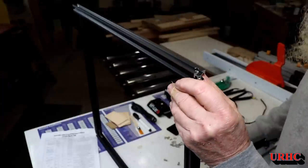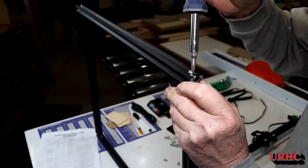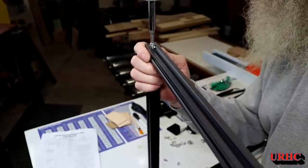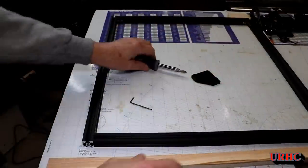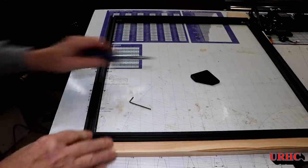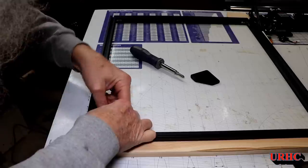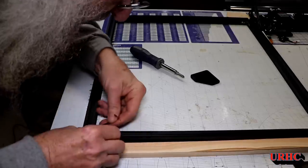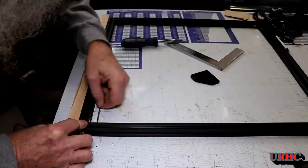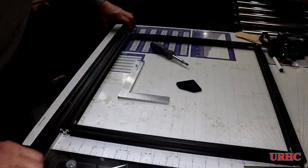It's really about 20-25 minutes of assembly time. You want a nice flat surface to work on — I'm doing it on my table saw. Before I tighten those corner screws, I used a straight piece of wood to pull everything flush and tighten the screw. Then I went back with the little corner brackets and found you tighten them a little bit at a time on each side so they pull together good, then crank them down. You just have to repeat that for all four corners.